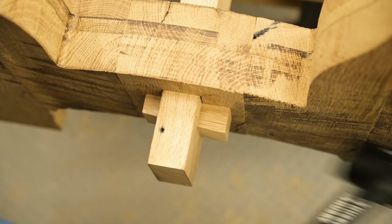So with that as well, we want to make sure we don't glue it in that hole and lock it in place. We want it to be able to move, but we do want these pegs glued, but only glued in the top. So to help make sure I do that, what we'll do is mark the depth here on these dudes. And now I know once I pound past that pencil line, I can add a little bit of glue, slip it in the rest of the way,